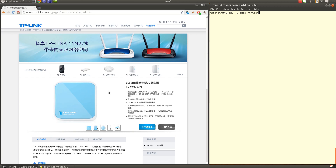You can use a Mac or PC and whatever browser you want. On this side I will use a terminal monitor because I installed in my router a small UART TTL-to-USB converter, so I have access to the Linux and bootloader console. That's pretty convenient because you can see what's going on under the hood, though it's absolutely not mandatory.